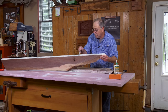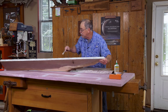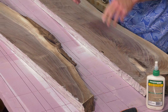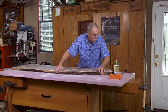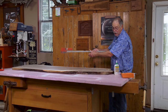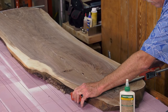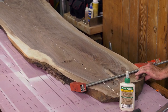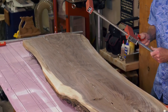True or false: you can make a wood joint stronger if you brush it out and size it into the pores of the wood and let it air dry for about three minutes before you put the seams together. It's actually true — studies show it's more than 20% stronger if you let that air dry. I'm bringing this straight from the planer and now I can clamp this up. I'll throw the clamps on thoughtfully; I do not want to spread that seam. This will take a good two hours to dry on a big seam like that.